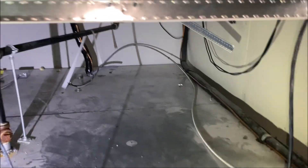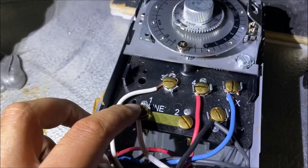The wires are out of the liquid tight, and the game plan is to bring the defrost clock right where I come up on the ladder. I always see guys running the defrost clock to the other side where the copper goes in — it doesn't need to be near the copper. For an extra fifteen dollars, you can run some more BX and bring it right near that opening so you don't even have to climb up. It's coming into that junction box there, and we're just going to bring this power to our conduit.